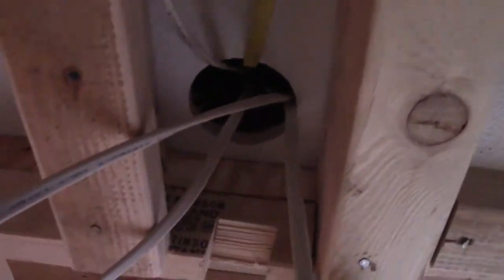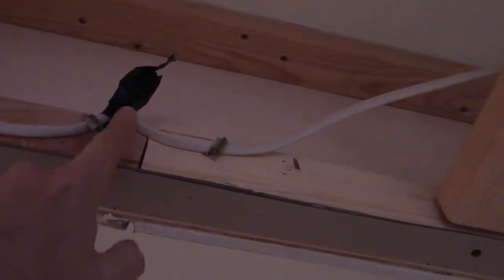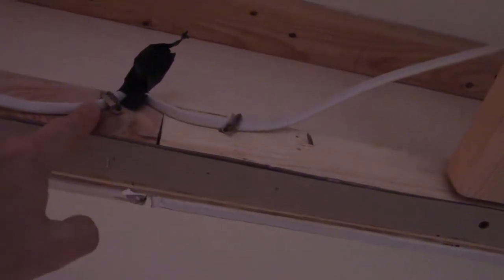As you can see, I've got a whole rat's nest of wires running everywhere, going up in the ceiling — it is a mess, but I'm going to tidy it up. I'm going to be running lights all through here, through the whole soffit, so you've got to make sure you've got plenty of electricity. Be careful — I really screwed up. I drove a staple in right there under a nail and didn't realize it. I ended up breaking the wire. So I fixed it, and that's not exactly to code, but it'll be okay.